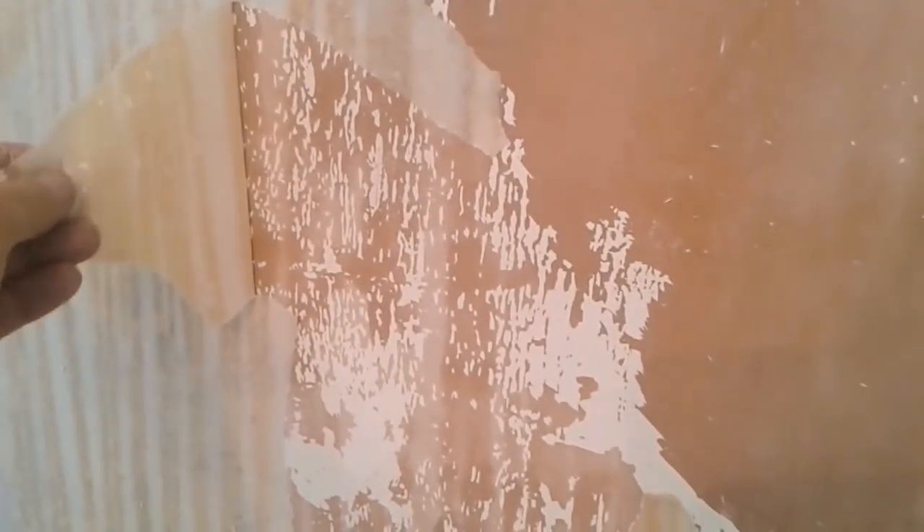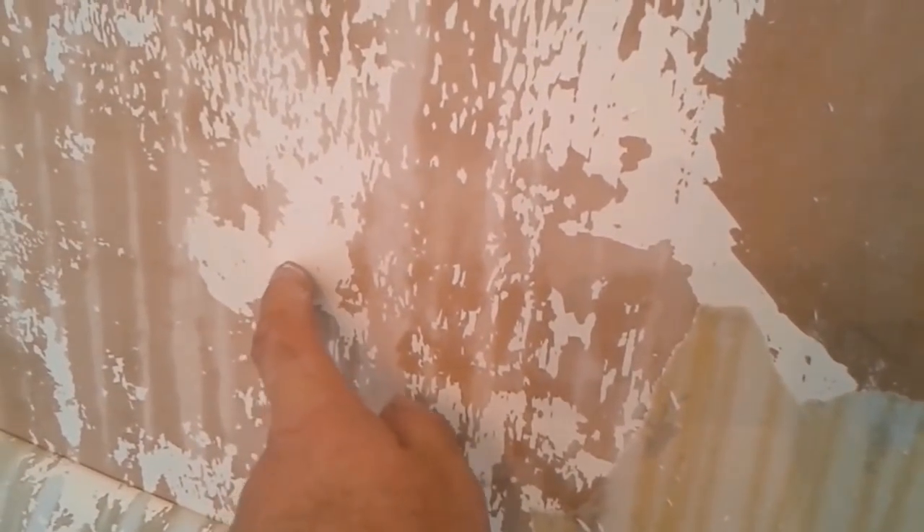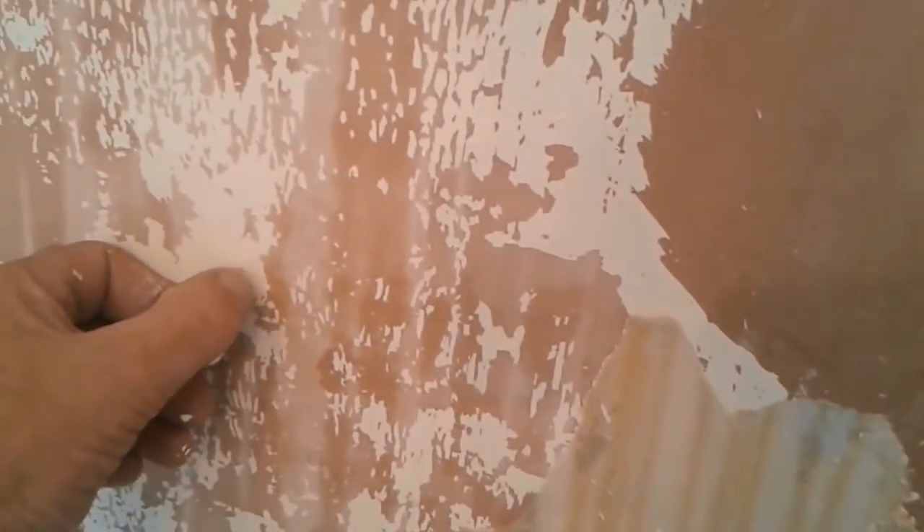This is coming off and I want to line this and emulsion it. But if I was to put my lining paper straight over this, see how this is wetting it off — where your joints sit with your lining paper you can start springing when you wet this paint. Also these edges will show up really badly under the lining paper.